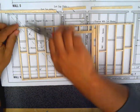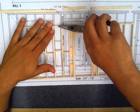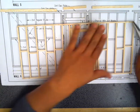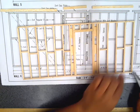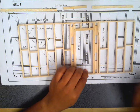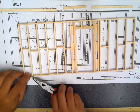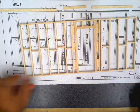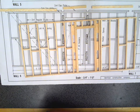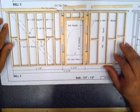Okay, now that I have the nails halfway out, it's easy to pull them out. That's the same method I would use in real life. If I had a nail in the piece and I could hit it out from the opposite side, from the pointy side, I do that for a little bit, then I flip the piece over or go to the other side, and then I use the claw of the claw hammer to pull it the rest of the way out, once you have a little bit to grab.